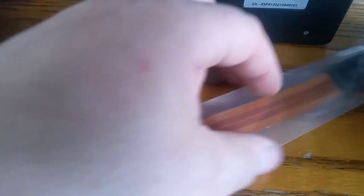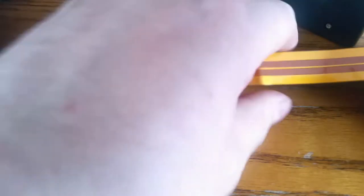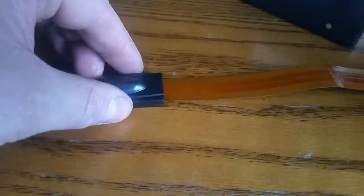So I thought I'd give a quick brief description - I shall open it, and no doubt it won't play ball. I'll see if I've got a knife. This is the result, and I must admit it does look flimsy. You've got a metal trace which will be the earth on that side, and two other metal traces which will be the earth also, but the centre one obviously will be the centre core and the actual antenna.